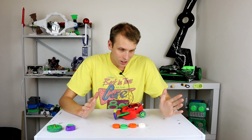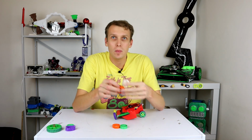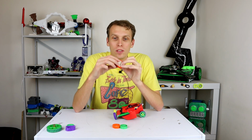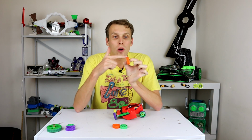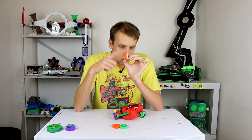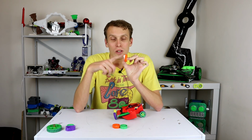So, what did we just learn? A lot, as it turns out. First of all, the failure mode on these wheels is not what I was expecting. I was honestly expecting that it would be the lateral forces that would push the silicone off these tires, but as we just saw in all of that testing, no amount of lateral force could do that, or at least the amount of lateral force needed is so high that you break traction on your drive wheel before you push the silicone off sideways. So that's an interesting thing.